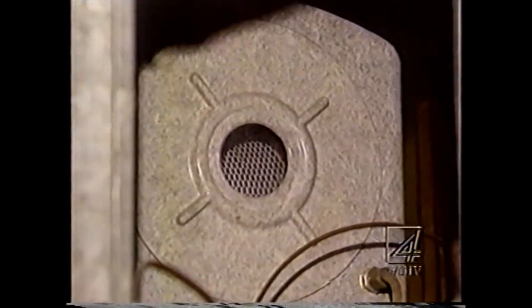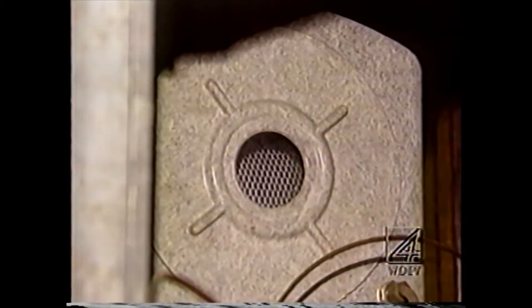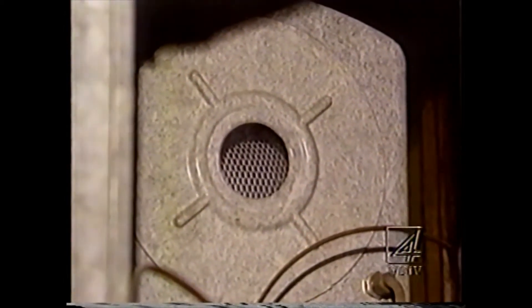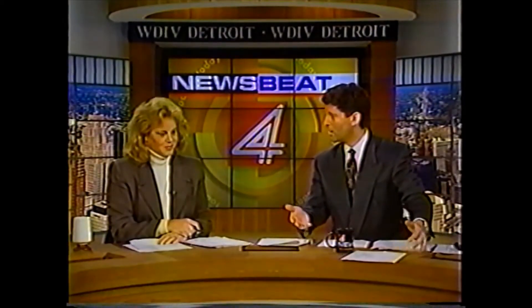We kicked on our furnace. The humidifier is basically hooked to the fan switch, so you hear the burners coming on and you've got to wait till the fan comes on. Then we can see that it's turning in there and it's getting wet with water. Our reservoir's full of water — we've got a good flow of water. We're back up in action. That's a pretty important feature because you can really dry out your sinuses and everything if you don't have that.